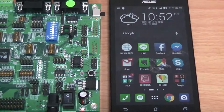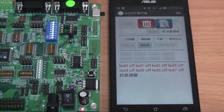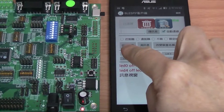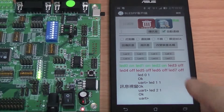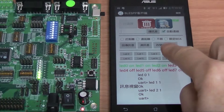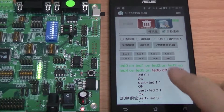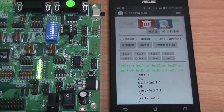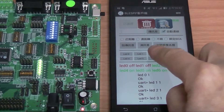First of all, click the smartphone app. After connecting with the BLE demo board, click the 8 LED control boxes on the screen sequentially. You can notice that the corresponding LEDs on the AS11015 evaluation board will be turned on sequentially. We can also turn the LEDs off by clicking the control box again on the screen.